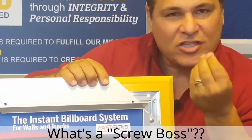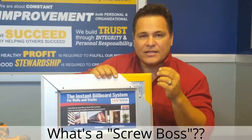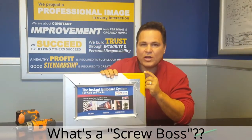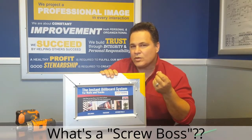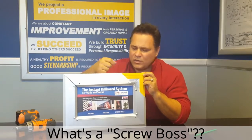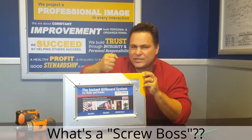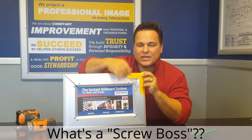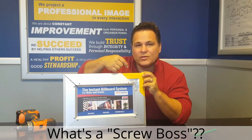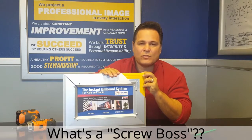It's just the right size and just the right alloy of aluminum that our screws cut their own threads — they cut their own threads down into the screw boss. One of the problems we had in the earlier days was sometimes installers would get out there with a big old drill and just lean into it. And it could strip because it was just a thin layer of metal that the screw would bite into, and then the screws would keep turning — it still functions, but not ideal, not as safe as we want it.